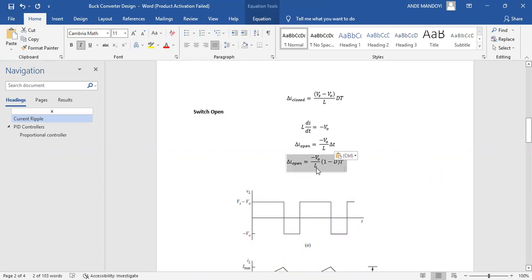Well, we want to see the inductance that'll give us a certain percentage ripple. Put in another manner, if we want 25% ripple, that is 25% of the load current, how do I explain this? If our load current is 1, and we can tolerate a maximum ripple of 0.25 amps, that's what we're going to substitute here in order to get L. That would give us 25% ripple. So this will then be our minimum inductance that will satisfy that ripple requirement.